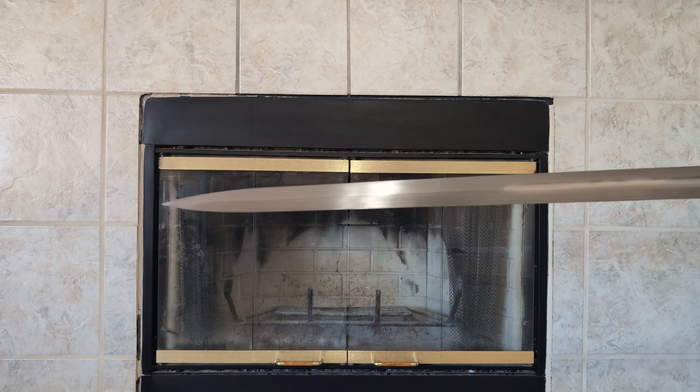The sword does come sharp with no secondary bevel — it is designed to be sharp out of the box. Testing the edge on some paper: starting with the true edge if holding right-handed, it pretty much completely failed to start the cut there, and again there. So it's got a little bit of a burr pretty much down throughout the entire sword, which kind of makes it hard to start a cut.